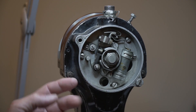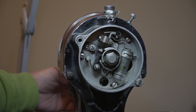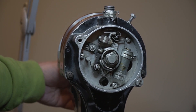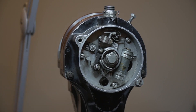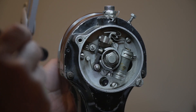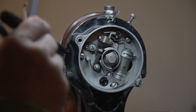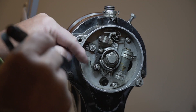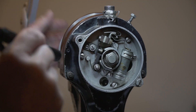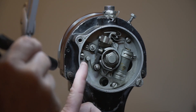The first thing we have to do is look inside of the window. There's a little dot that shows up inside of the mag - a little white dot. That dot may be a dot like we're seeing here, or it may just be a mark that's in between the teeth to let you know where the number one point is sitting.